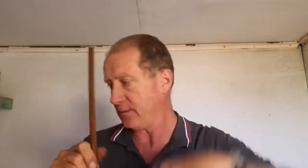So ladies and gentlemen, we're out in the smithy now. I've got two pieces of steel with me. This one is just 10mm round bar, 3/8 inch. This one is 16 inches long, that's 400mm. And this one is 525mm, which is 21 inches long. One of them is 5 inches longer than the other because that's the one that makes the curl around.